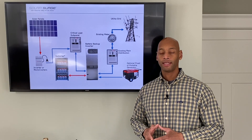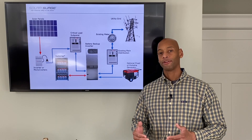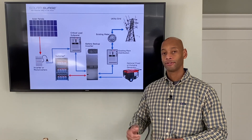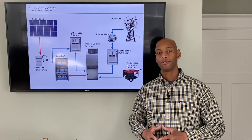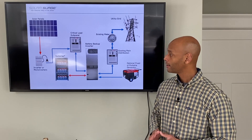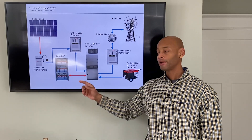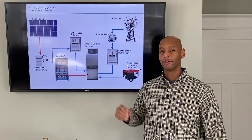If you're an existing solar homeowner who has been through the experience of having your solar panels shut down when utility power goes out, and you're interested in a way to add battery backup power to your solar system, that's what today's video is about. The technique we use to do that is called AC coupling, which means the connection between your existing solar panel system and the new battery backup system happens at the AC side of the system, at the AC circuit breaker panel.